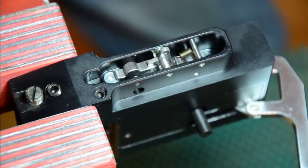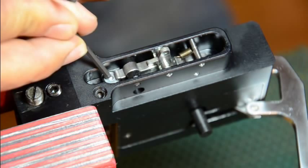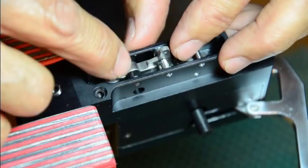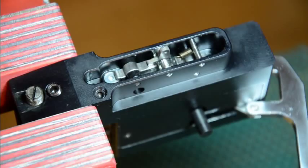Put that to the side. Now here is the adjustment screw. You need to put the O-ring underneath it. To do that, the shear has to be removed. To remove that, you have to push out a little pin here holding the shear and the plastic bushing.